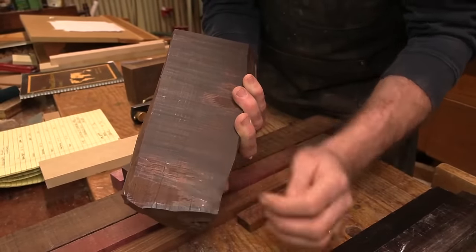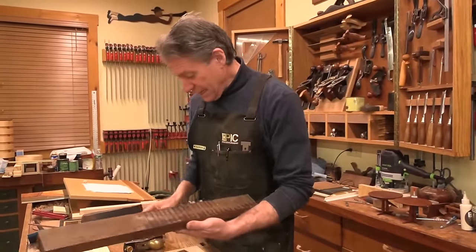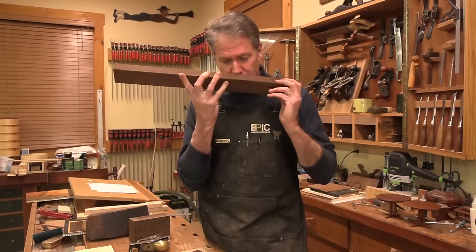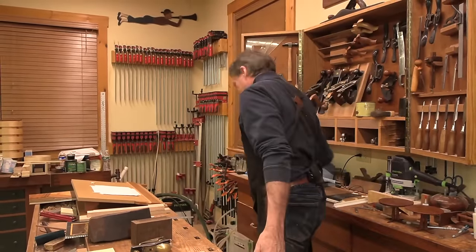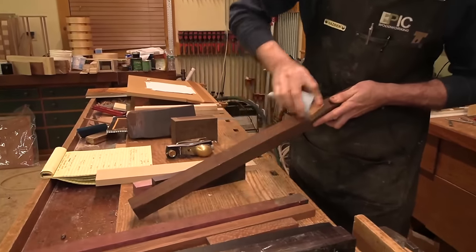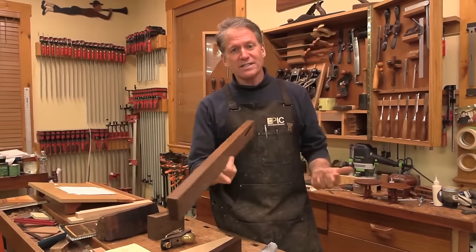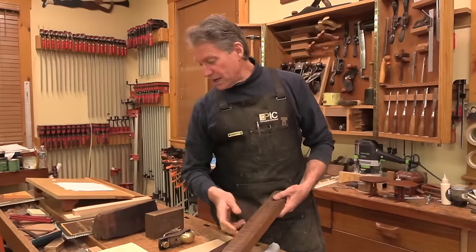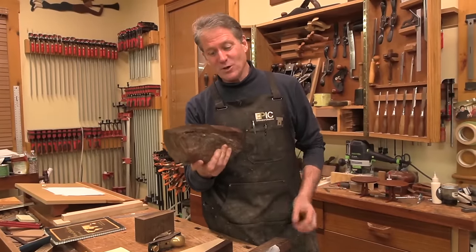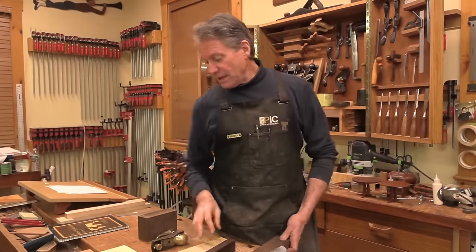Here is another kind of rosewood — I think the best of the rosewoods — Brazilian rosewood. When you plane or sand it, it has a reddish tone, but it's the fragrance: you get this sweet, flowery fragrance from this wood, which is where it gets its name. Cocobolo is 1.1 on the specific gravity, so it would dead-sink in water — and when you feel it, it is literally like a large boulder. And then there's bloodwood, which is just under one at 0.96.